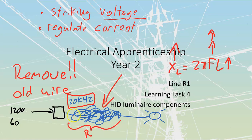So if you're taking apart fixtures ever, and you're reballasting, don't be that chump that's just cutting off the wires, marettes on the other ones, right, tight to the ballast, and then just packing more up inside of that fixture. You want a minimum amount of wire. A little bit of extra is not going to kill you. To have a foot or two of extra maximum inside of that fixture is perfectly fine.